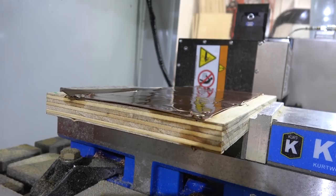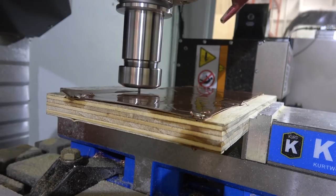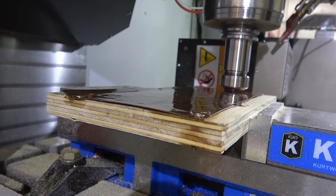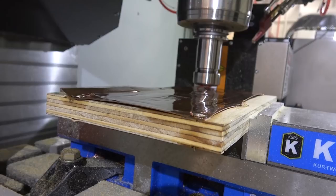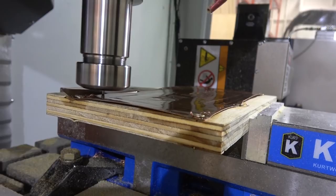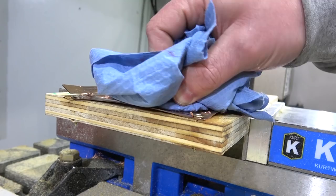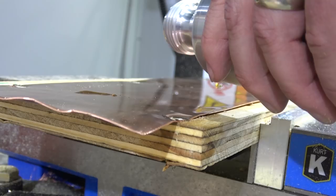We'll go to program reset and hit the go juice. Here's where it broke last time. Tough to see if it's doing anything running a braille-dot of a tool, but it'll do a number of passes. We're going to a depth of 80 thou — that's about two millimeters of raised lettering, a fair chunk. With some optimization, it's an hour and four minutes. We're starting to pick up some metal chips. Changed the program — not as deep, going with thicker oil, quite a bit more aggressive. That's going to take nine minutes to machine, so yeah, it might get ugly.